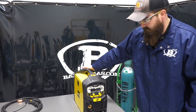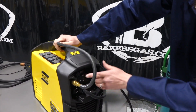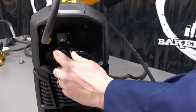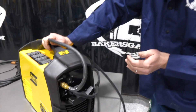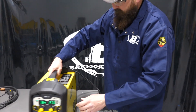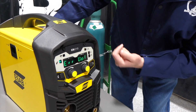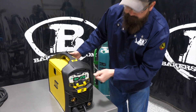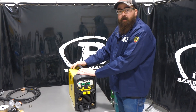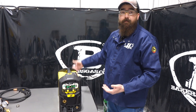On the back of this unit you can see the on/off switch and a selector switch for what voltage you're running. We're hooked up to 230, and you can flip it up to 120 if you're going to run 110. It doesn't have an auto-detect feature, but it has a manual selector. To show what happens — if we flip it to 120 while plugged into 230, it knows there's not 120 hooked to this machine so it throws an error code. Flip it back down and it comes right back. That's what put it at this price point, but I don't see a big deal — you just have to know which voltage you're running.